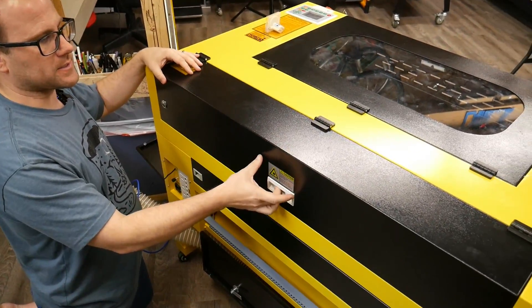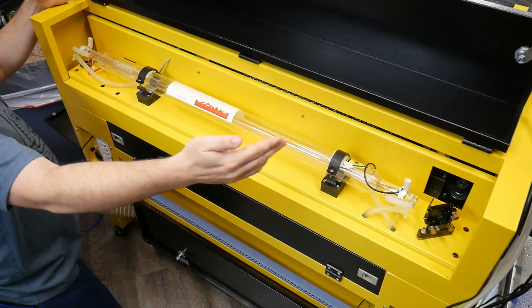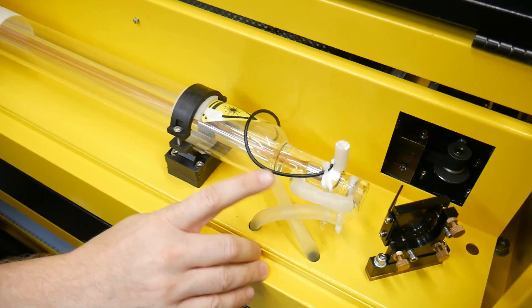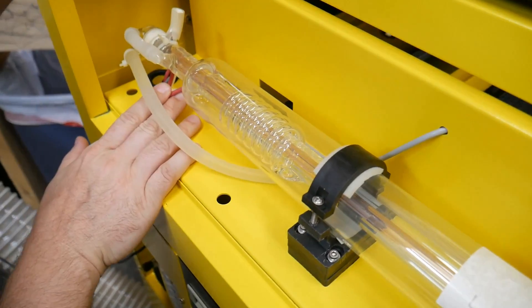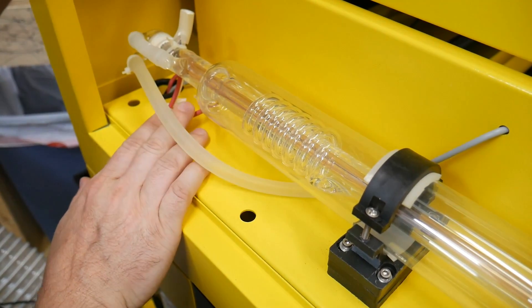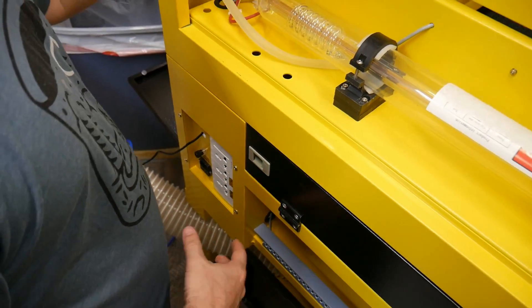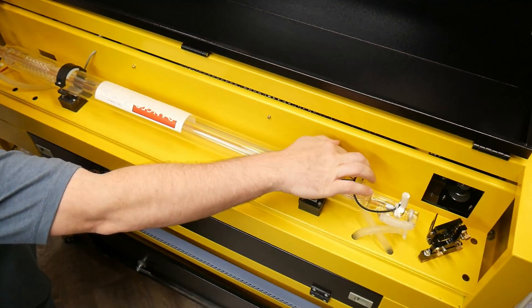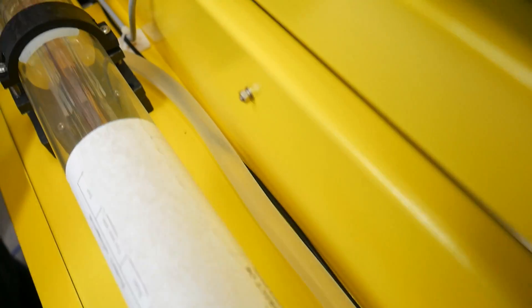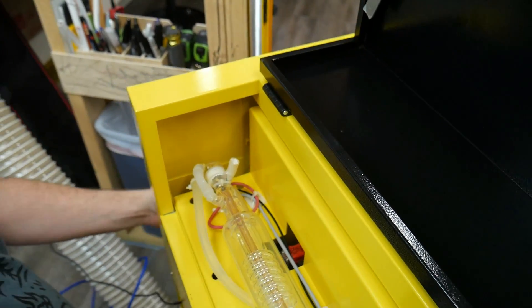We're at the back of the laser. We're going to raise this up to give us access to the laser. You can see we have a wire down here which is the output — this is where the water will flow out. We have a black wire, thinner gauge. Following up to the other side of the tube, this is the input. We have a thick red input. We're not going to mess with the red — that one's high voltage, we'll kill ourselves. We're going to make sure we're unplugged from all power right now. We've actually been unplugged for probably two days, so we know there's no power flowing through this. We're going to follow this black wire down, and we can see it runs along the tube all the way over here, coming in on the side right where the black and red wires come in from the power supply.